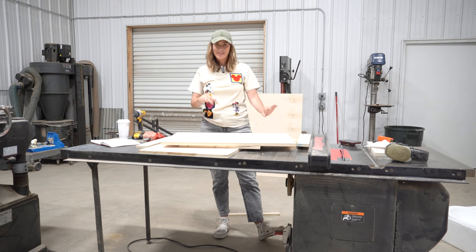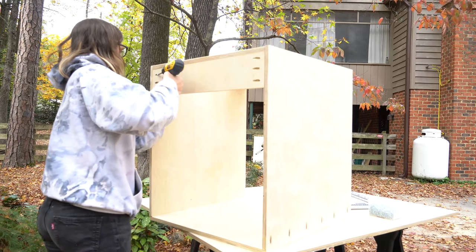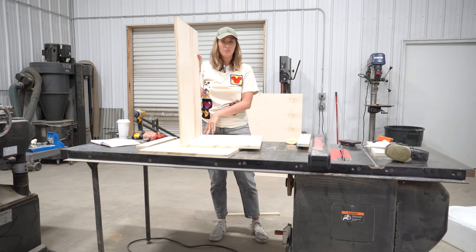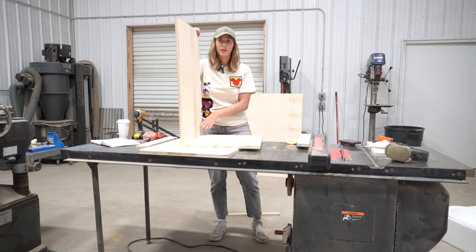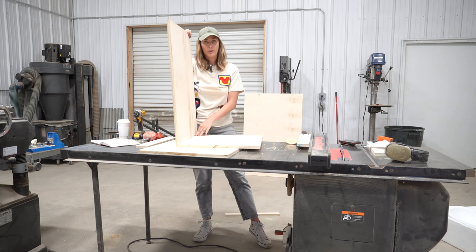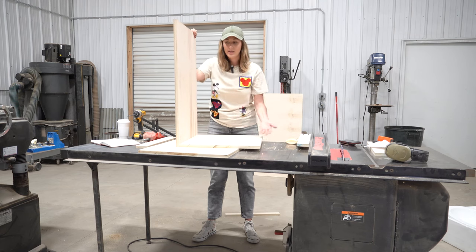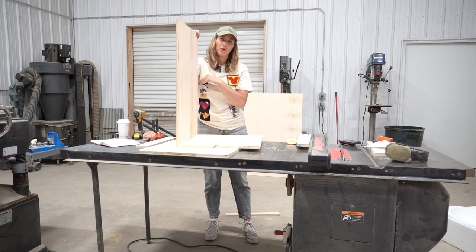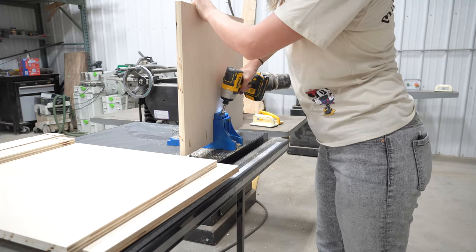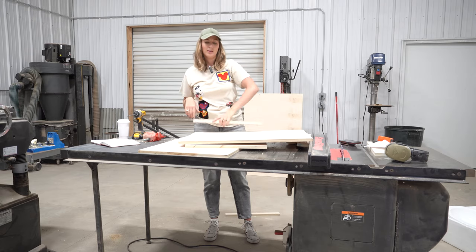I have the five pieces I need to build this cabinet carcass. Previously when I built a cabinet carcass, I had the side pieces resting on the bottom piece to support the weight. But for this vanity I don't want the plywood edge showing, so the side pieces will float to the side and the bottom piece will screw into them. I'll also build a frame underneath so the side pieces rest on wood rather than relying solely on screws. I've already drilled pocket holes for the bottom board and both support pieces — let's build it.